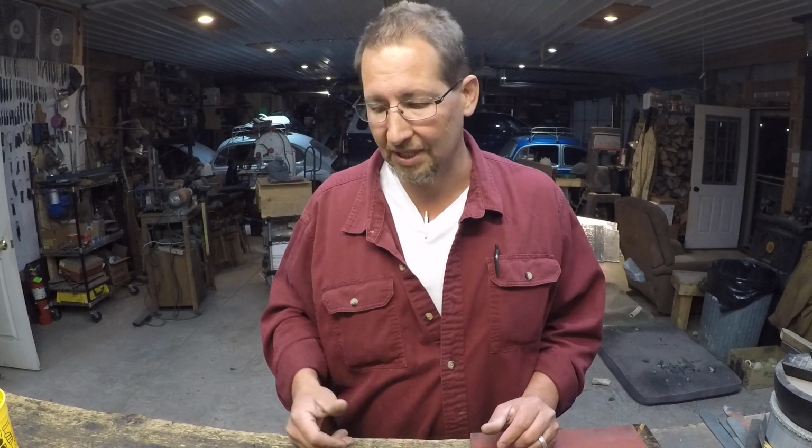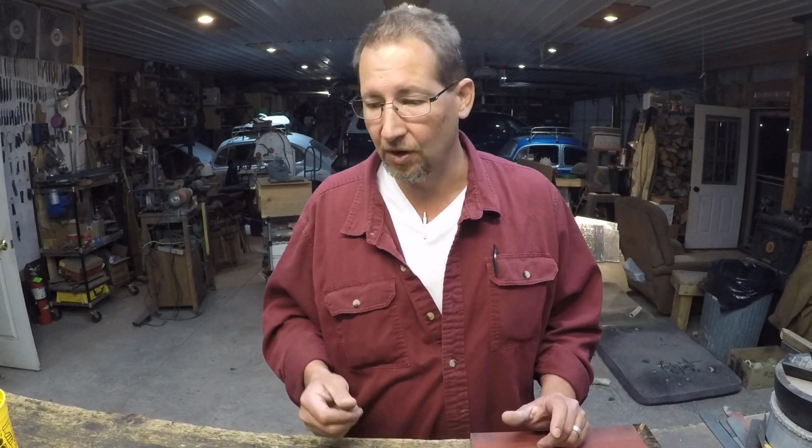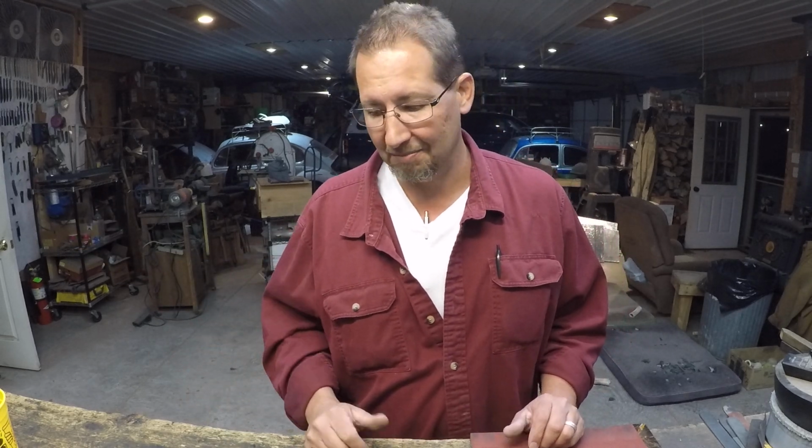Usually the latest and greatest steels are the highest-dollar steels, which means the guy's going to be like, well, I don't want to waste all this steel, because you don't get paid for the test knives, right? When you're working up a new heat treat for a new steel, you might break a dozen knives, and then you finally come up with something that you think might be working pretty good. So you make a pocket knife out of it, and you carry that knife for 6 months. At the end of the 6 months, you're like, man, this stuff really just doesn't live up to its claim, right? All those knives that you made and broke and tested, you don't get paid for it, okay?